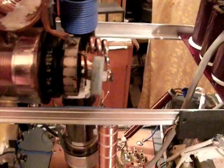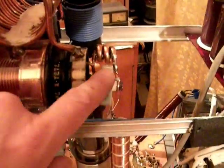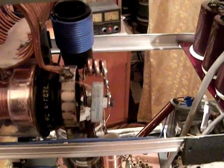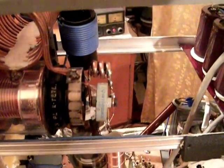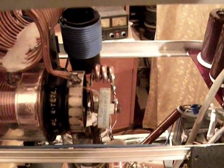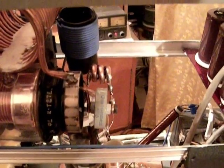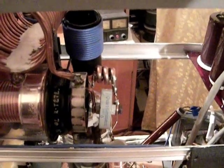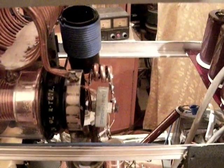Separation between the high voltage and the Pi filter is done with this Russian doorknob capacitor rated at 15 kilovolts, but lower can be used also — anything higher than 6 kilovolts can be used. The parasitic suppressor is built using copper pipes from a brake system of a car — in fact a Dacia brake system copper pipe.